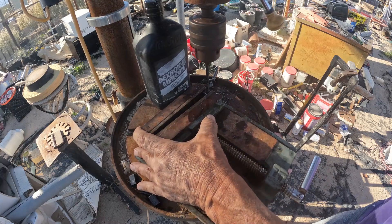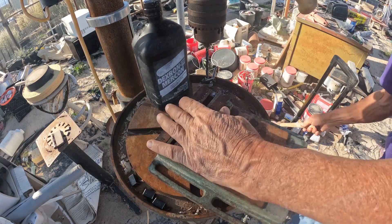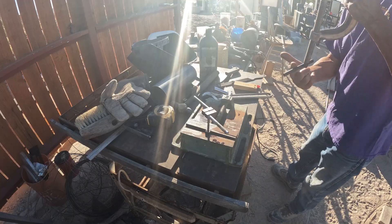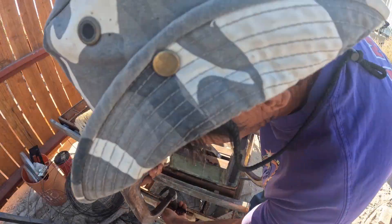Here I'm drilling and tapping for a half-inch by half-inch solid bar, and now I'm about to tap it with a quarter 20 tap.